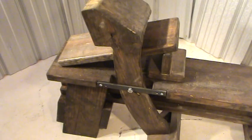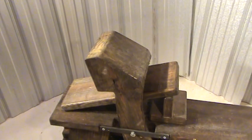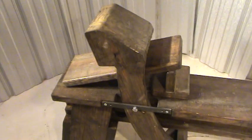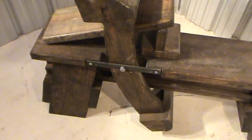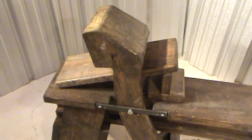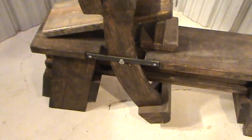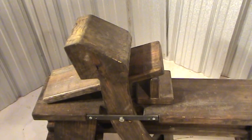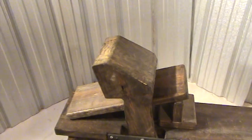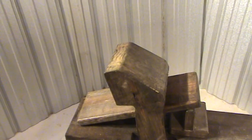The next step is to come up here, figure my angle with a pencil, and cut out the board. I just hand drew a radius on it, so it's all one board right now. I set it so that when I push down with my foot it strikes the table. Then I cut some angled pieces of wood at the same angle and laminate and screw them together to give overall thickness to reach all the way across the table.